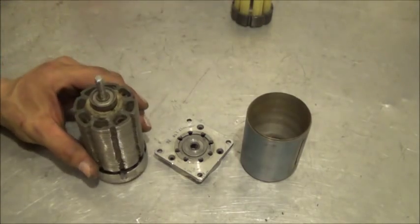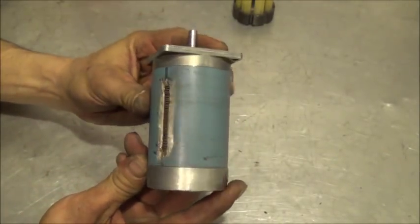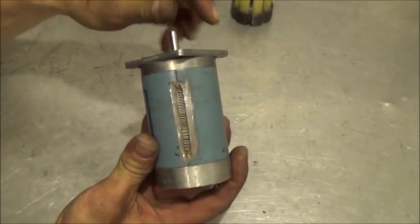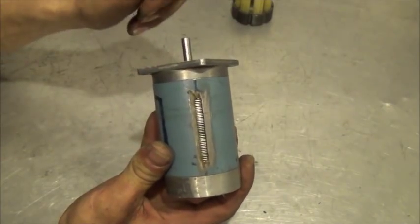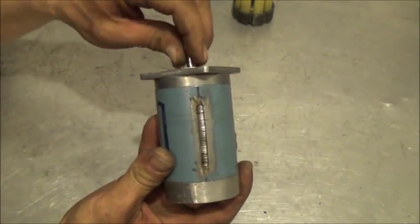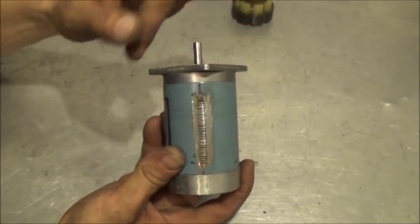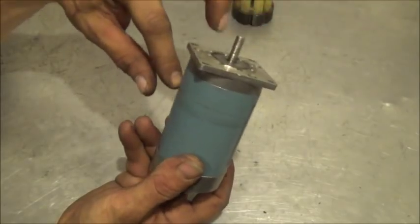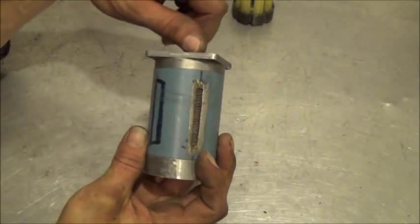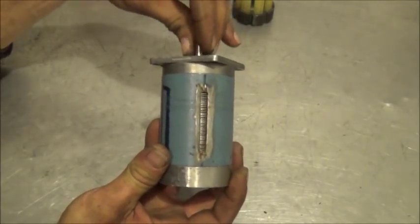We now need to build an outer case around this that's going to get the air or water flowing in a vortex direction, spinning it into the case to deliver that force into our Tesla turbine. All we have to do now is put this all together — put on the outer case and add some pressure. Now that it's back in the case, we've got our output holes on the front and the back. You can hear a little bit of the magnetically charged dust still in there — I haven't blown it out with an air compressor yet. It's very difficult to get the dust off those laminate plates because it is a magnetic rotor inside, which is very unique when we talk about water because water has a diamagnetic presence that may create some very unique effects. I've already noticed by putting this in water and spinning it that the water coming out in one direction holds very tight to the case — the pumping effect is very unique. Spin it the other way against the hard edge and it sprays straight out.